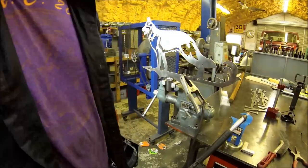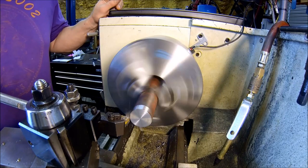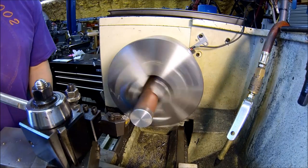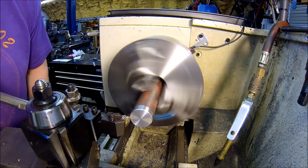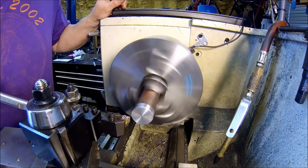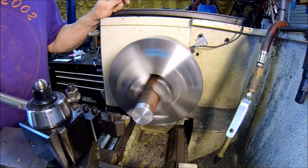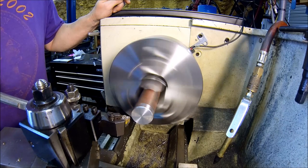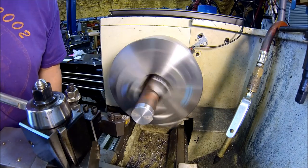Alrighty. Alright, got you at the lathe. Just gonna make the piece that's gonna go in. Well, I need to speed her up or increase my feed to get rid of that chatter. But anyways, this is the piece that's gonna slide into the stubby that we made for the weather vane that's got the inside thrust bearing. It's just a piece of mystery metal.